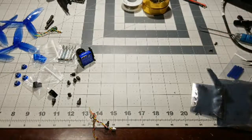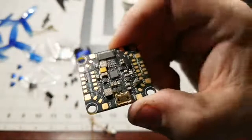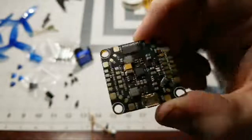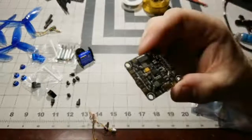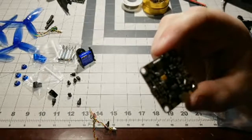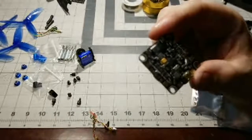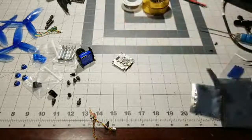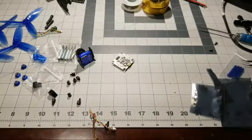Race Day Quad. There you. Yeah, there it is, right there in the center. You can barely see it. There's the MPU 6000 gyro, very, very small, right there in the center. But yeah, this is susceptible to noise and vibrations, so I can only run at 8K and 8K. But you know what? 8K and 8K is good enough, to be honest with you. I haven't really noticed much of a difference going from 8K to like 32K sampling and stuff.